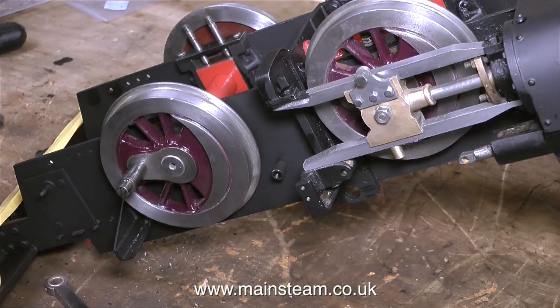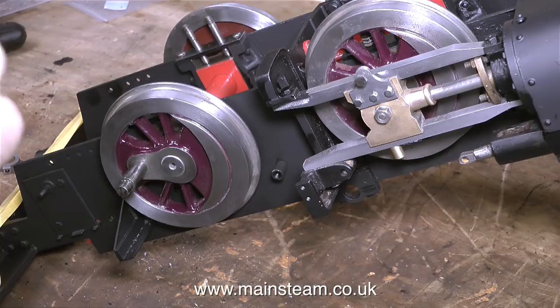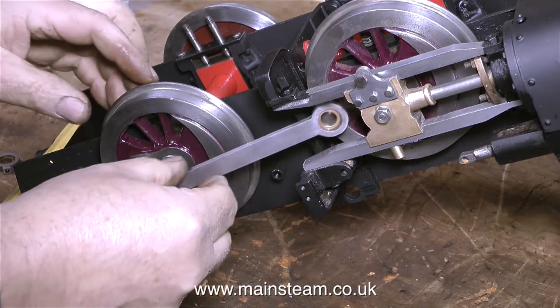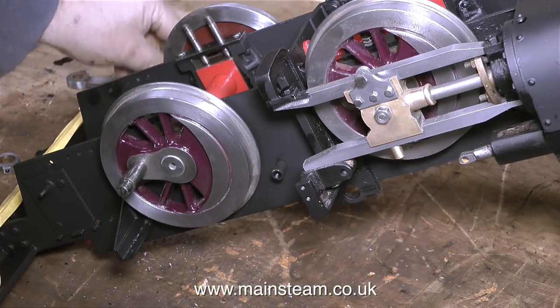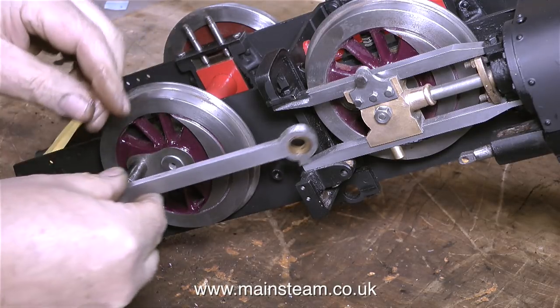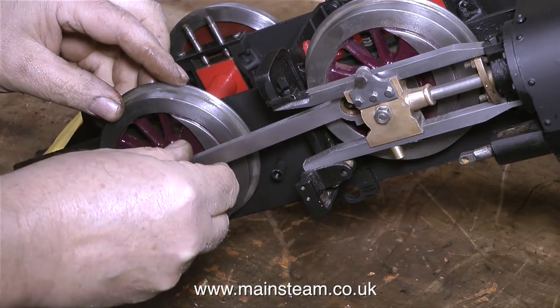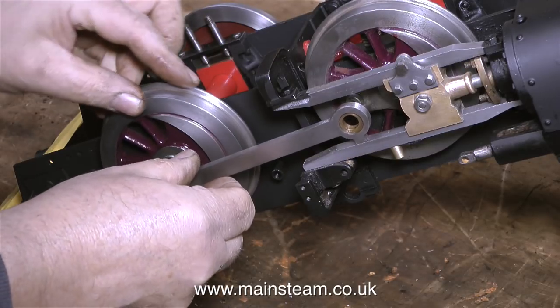When I work on things like this, I can soon get into the mindset of the builder, and there are some fundamental things with this engine that I need to put right. Damage I found underneath the suspension was quite severe and confirms the engine must have come off the track many times. So just to recap: I drilled out the hornstays so they don't foul the studs anymore, and I'm going to fit some weaker springs.